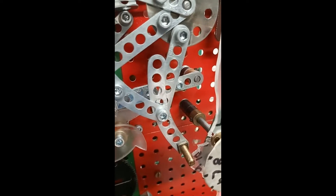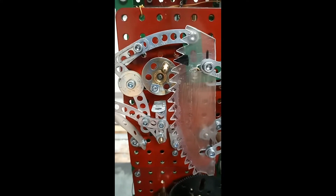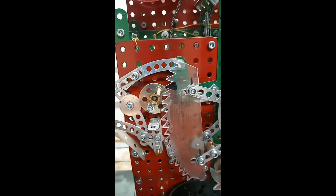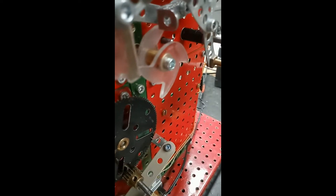I managed to run it too far so we didn't see the rack drop, but it did. You see here that the threaded pin is resting on the ten position of the snail. That means that this bush wheel with the pin — or the pallet, as it's called — will have to lift up the rack ten times, ten teeth, and then the chiming will stop. There's another cam here, difficult to see because it's behind the quarter-hour cam. When it drops, this will start the mechanism and the clock will strike, hopefully, ten times.